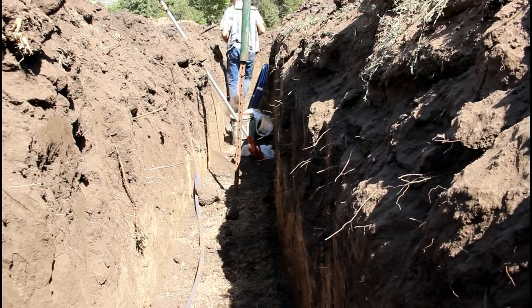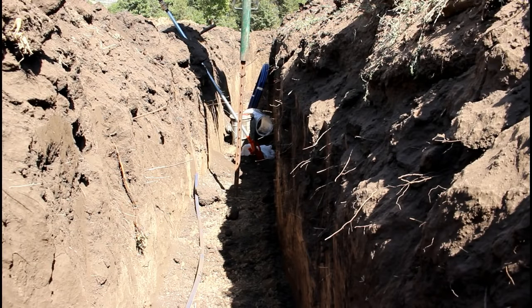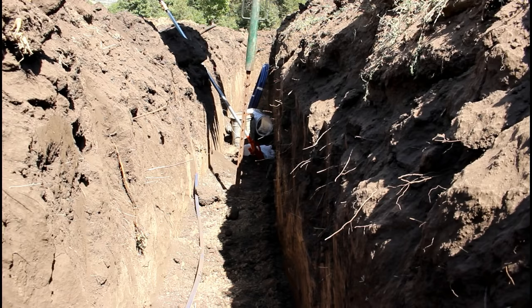I'm using galvanized tie wire to tie the hydrant off to the t-post. When tying off the hydrant to the t-post I try to lift it off the ground just a tiny bit so the weight of the hydrant is not sitting on the PEX fittings.